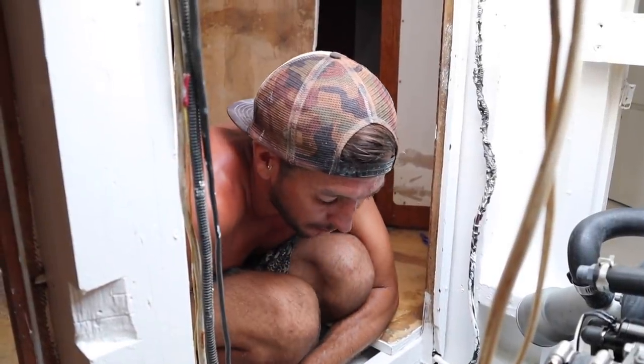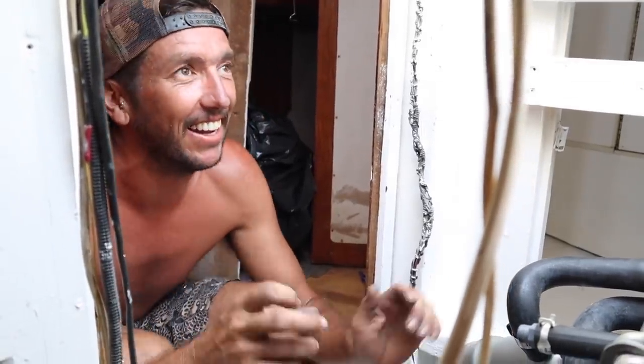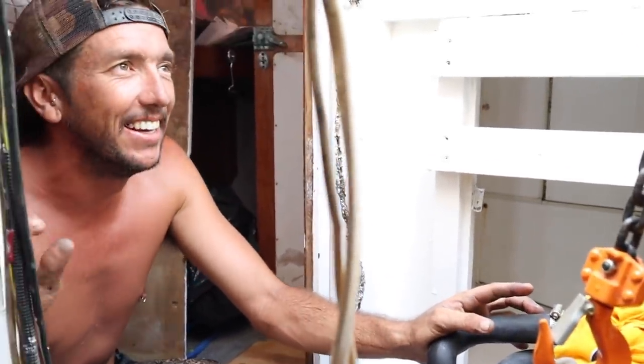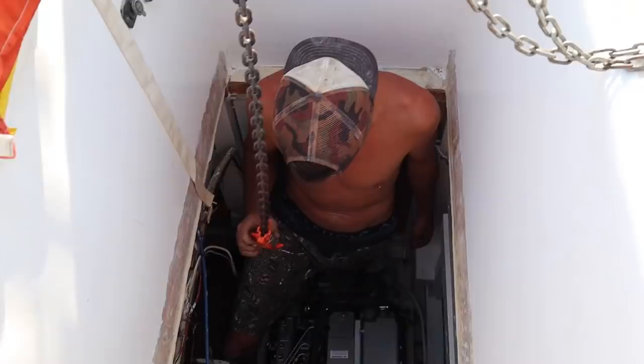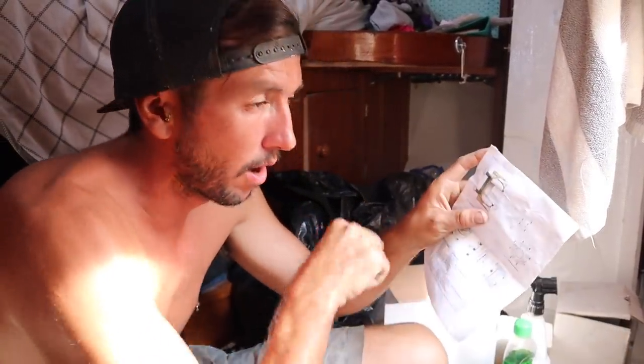So I'm really stuck with that alignment. Let's take this chain block off. The motor's in! Let's get this out of here and put a floor back in. We're tightening the Sigma Drive — it's like changing a tire, you just have to go around in a star pattern, working your way around so you're evenly pulling the shaft up and clamping it down into the Sigma Drive. So we've got our star pattern to follow.